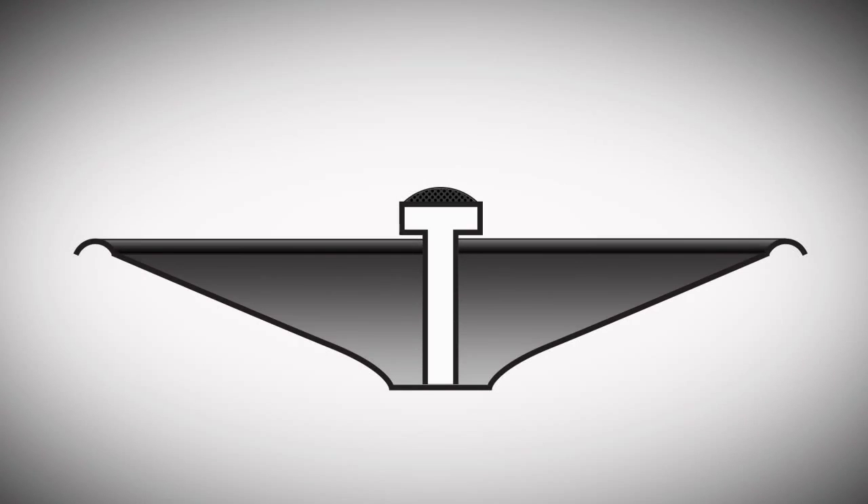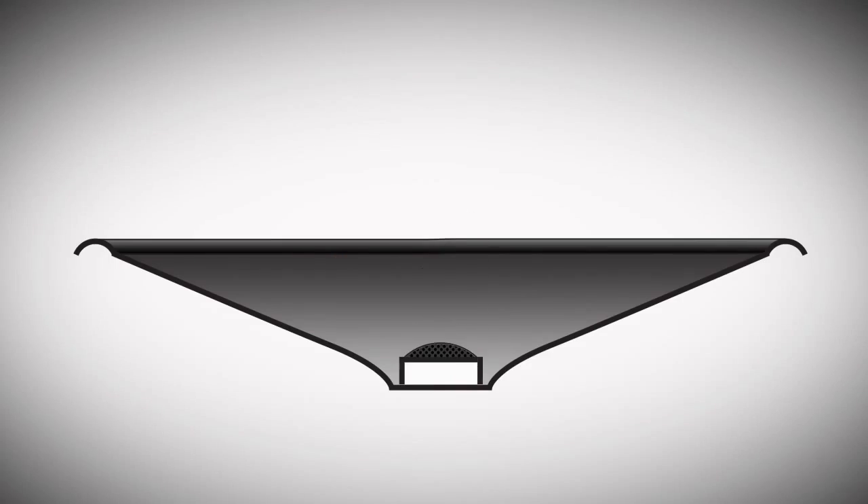One thing that is very unique to our two-way coax Prime speakers is we've changed the way the tweeter is mounted. Traditional coaxial speakers have a tweeter mounted on a post that comes up through the middle of the mid-range cone. One of the advantages of the coax speakers in the Prime family is that we've done what's known as a point source mounting.